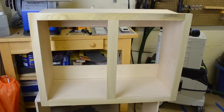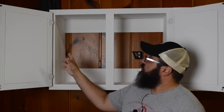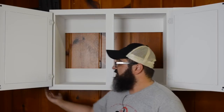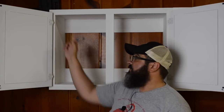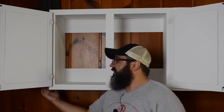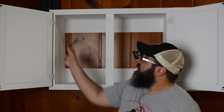To attach the face frame to the rest of the cabinet, we're just going to do more pocket hole joints. Now, some people might think — doesn't that make it look ugly? Well, if the outside of the cabinet were the show face, I'd drill the pocket holes on the inside. But in this situation, this whole run of cabinets is going to be tucked into an alcove, so nobody's really going to see the outside pieces. So I drilled the pocket holes on the outside — a couple on each side, and one on top and one on the bottom. That gives it a very nice clean look on the inside.